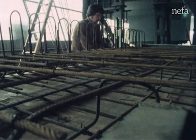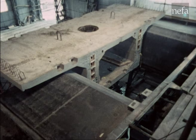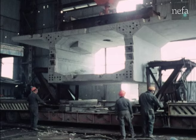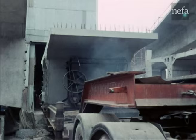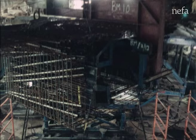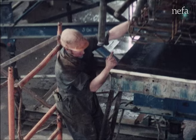In the preparation area, new cages are under fabrication to keep pace with the daily cycle. The segment cast yesterday, after it has been cured and surveyed, is moved to vacate the casting position. The previous segment, two days old, is ready for transfer to the stacking yard. As one box leaves at cycle end, another casting cycle begins. The empty pallet is transferred to the vacant casting position, and the cage moves across from the preparation area to the casting machine for placing.